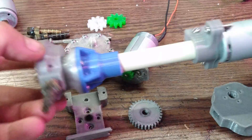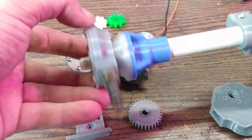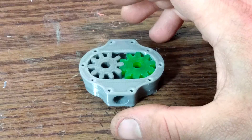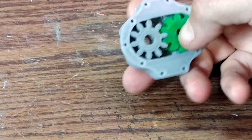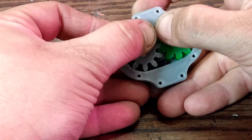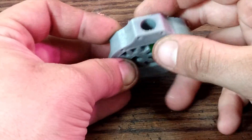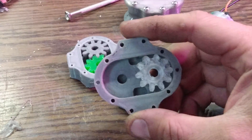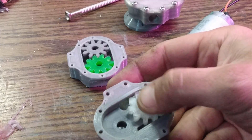The long drive just has a shaft that couples to the original motor shaft or pump shaft. How the external gear pump works is: fluid comes in from whichever side depending on rotation direction, is drawn around the gears and sealed by the mesh and the walls on the outside, then pumped out the other port.